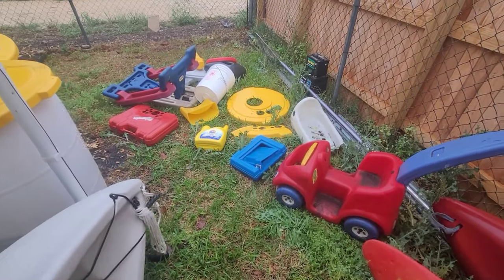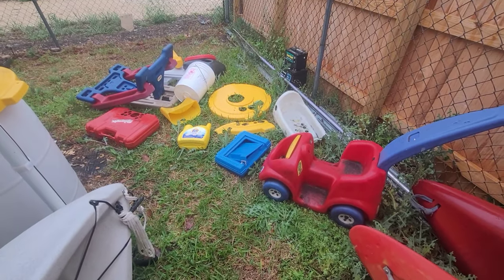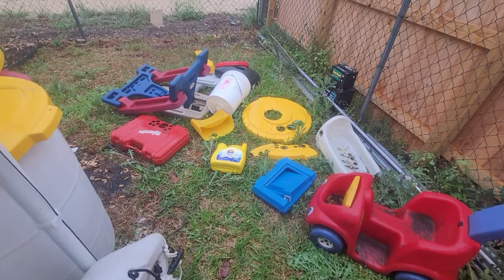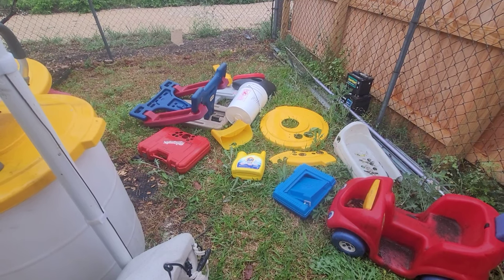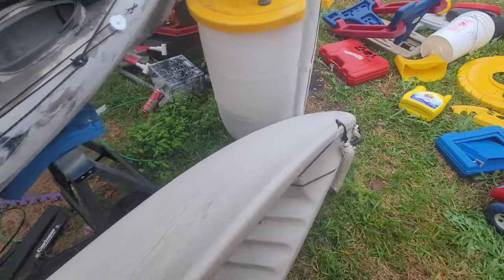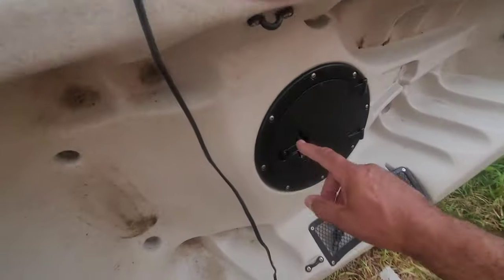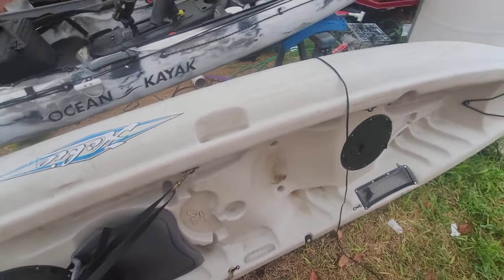These are your sources of plastic — Play School, Little Tykes, they're also essentially the same thing. These are great sources. I don't use any chemicals or products — no fiberglass on plastic, no Bondo, no putty. Hot plastic sticks to hot plastic. Silicone is fine for running a bead around a hatch when installing, but don't gob it on the outside.